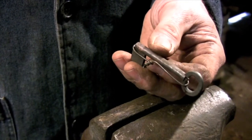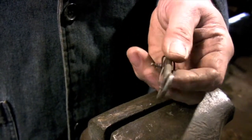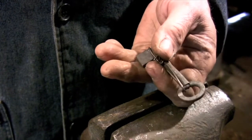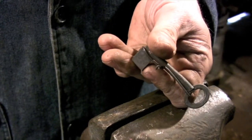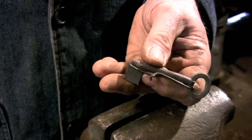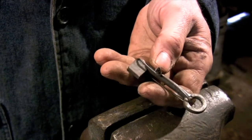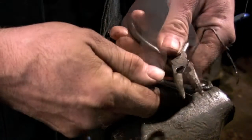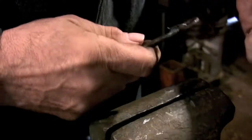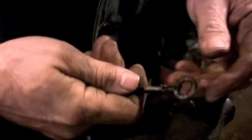Sometimes you need to wire pieces together to keep them in place in the fire. This shot was taken before I threaded the copper wire around the joint. The wire does get brazed into the finished joint, but it really doesn't take that long to clean up.